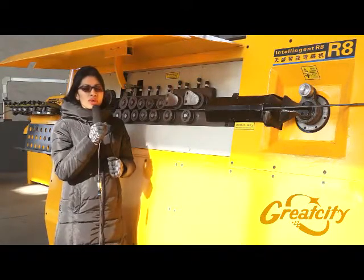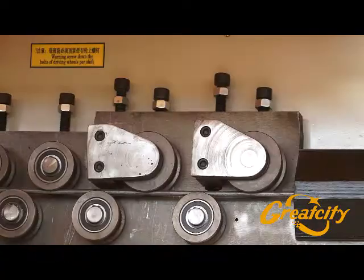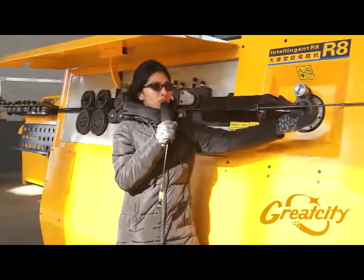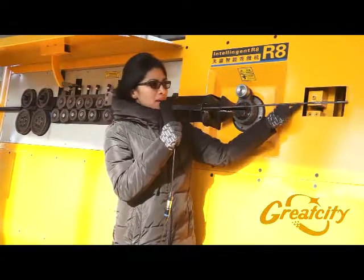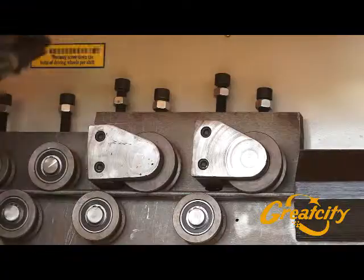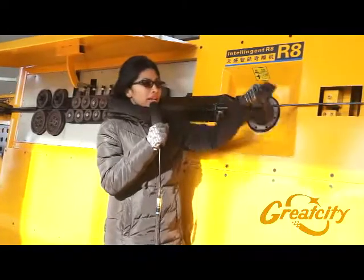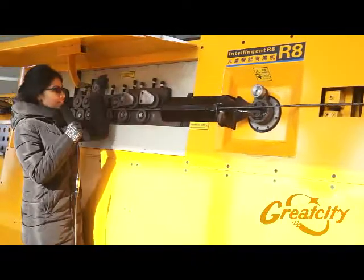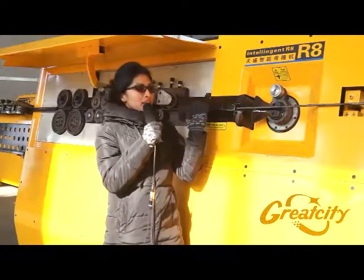Before cutting or bending the wire, go back to one particular wheel. When you move the wire forward until it reaches this area, if you see that the wire is going up, you have to loosen this wheel a little bit from this screw. If the wire goes down a little, you have to tighten the screw. The wire normally has to be straight.